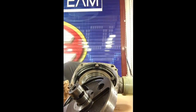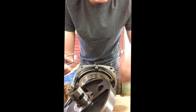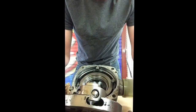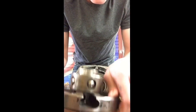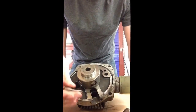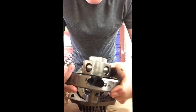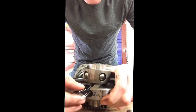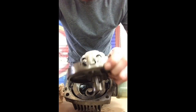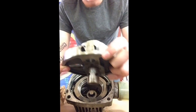Guess what just dropped? This is what dropped. It's a little piece that controls both your dump valves. How it goes together is you have these two springs which go on the dump valve rod like that, and they go down those two holes just like that. This dump valve presses on two tiny little balls down at the end of those bores.